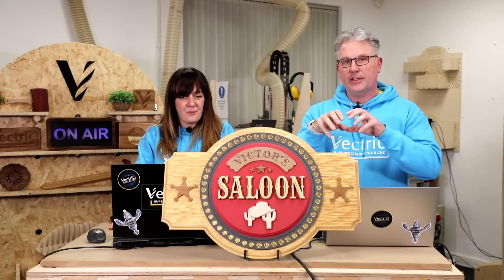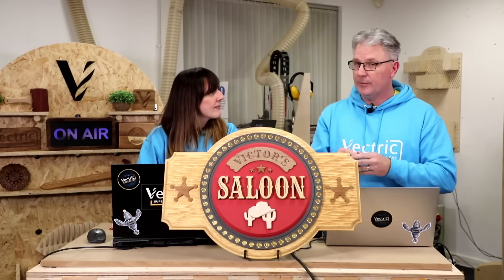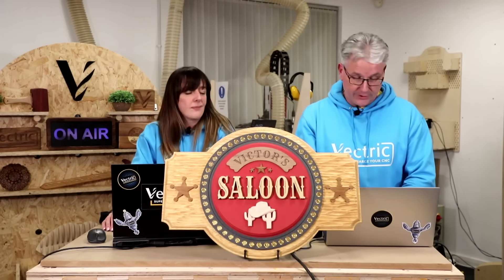One of Ryan's top tips was about radiusing all the corners of a piece of artwork using a gadget called 'Radius All.' If you go looking for it on our gadget site, it's not available for version 12 — it's available in version 10 but not supported in 12. An old-school workaround: select your vectors, offset them outwards half the radius of your tool, inwards twice that amount, and back outwards again — that will round all the corners perfectly and ensure your bit gets everywhere it should.